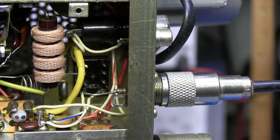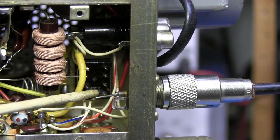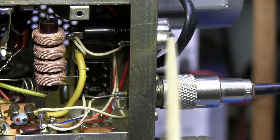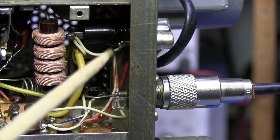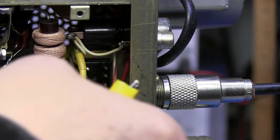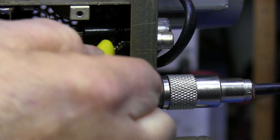Going right here, you can see the antenna jack coming in — that's the wire from the antenna jack. We can also see the receiver phono port on the back, and here's the wire for that. What we want to do is take a jumper wire and clip on to the antenna lead, then clip on to this RCA connector to test the receiver path.